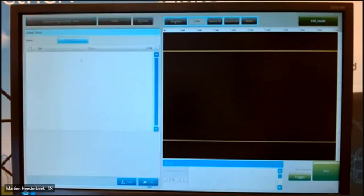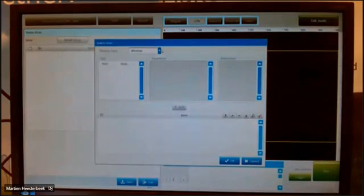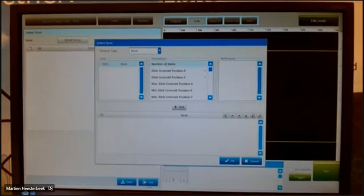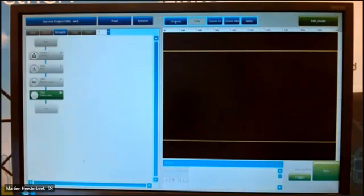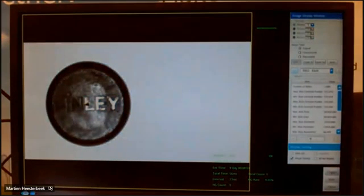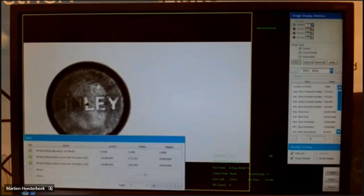For me, the status is more important, because the status will be on the screen. I have the same setup here. I can show you the amount of blobs. I can show you the X coordinate and the Y coordinate, for example. Now I have set up 1 program. I can go directly to run. I see here on the screen my cap. I have found 1 blob. This is live information. But of course, I can also show you the item list.